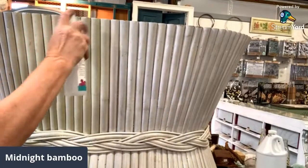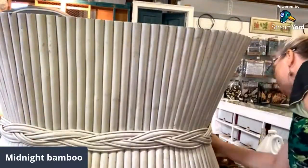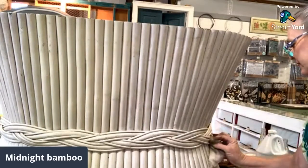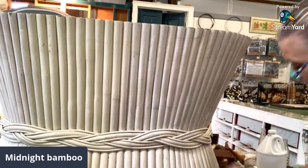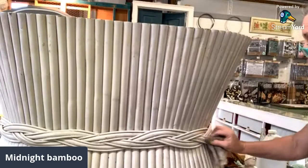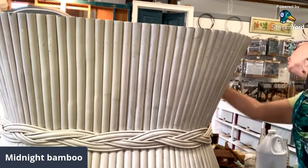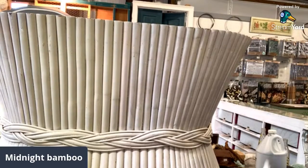And let's prep this side. If you want to distress this paint easily, quickly, simply, once you finish painting it, take a clean rag, not your dirty rag, but a clean rag, and spray a little prep on it and distress it with the prep. Guess what? It'll work. And let's go to it. I'm going to go right up against what's drying without disturbing it.